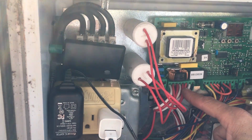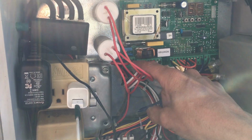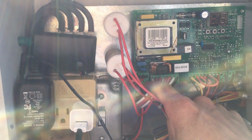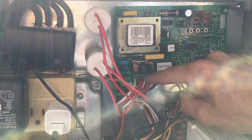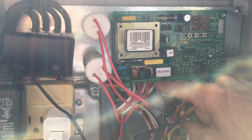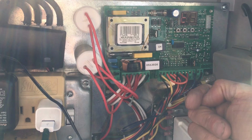And then in here, to check if your motors are bad or good, you can pretty much go from 1 to 2, 1 to 3, that should be like 60 ohms, and then 2 to 3 should be 120 ohms, and then 4 to 5 and 4 to 6 are about 60, 70 ohms, and then right in here, you can test that 140 ohms. I would not take these apart. You can definitely pull apart the harness and check your resistance on the back side.